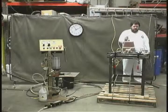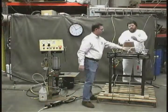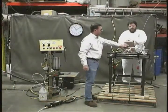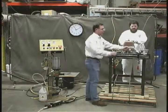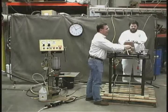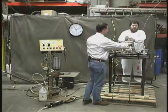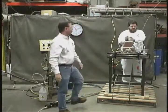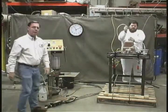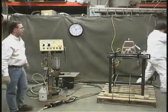Now we're ready to open the mold. We've given it time to cure. You can feel the exotherm throughout the part having warmed the mold. The tube is solid and will snap over. Now, depending upon the type of resin that you have, some snap — especially filler — it just cracks right away, but this is broken away. You'll see Don removing the cavity vacuum port tube and then the injection tube, and then we'll open the mold up together.